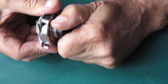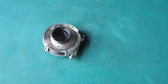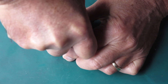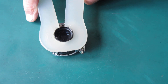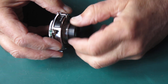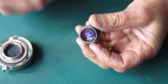The rear lens group should unscrew with my fingers - it doesn't. I need to find a tool; someone has been very enthusiastic about doing things up. First call: a friction tool. That won't shift it - this is very very tight. Let's try this then. Now looking at the notches here, someone's had a tool in there to tighten that lens up. It only ever needed to be done up finger tight.